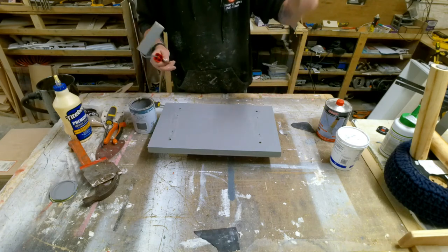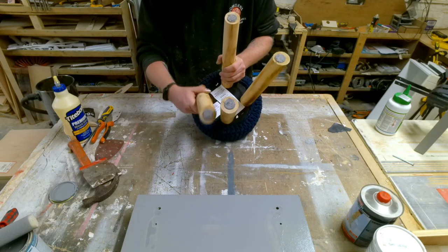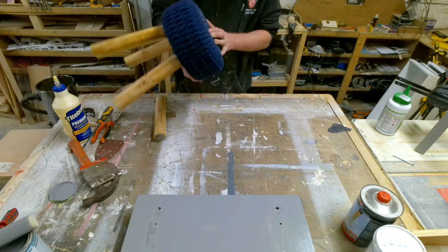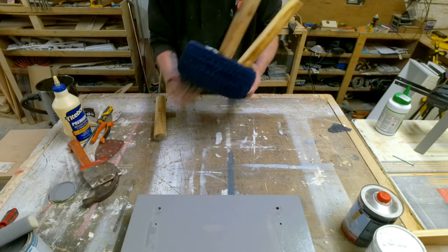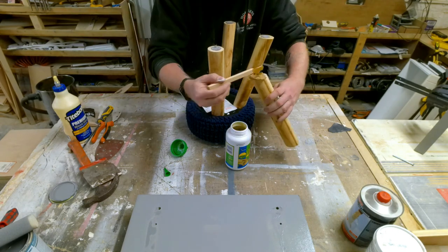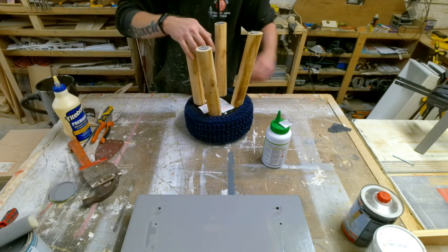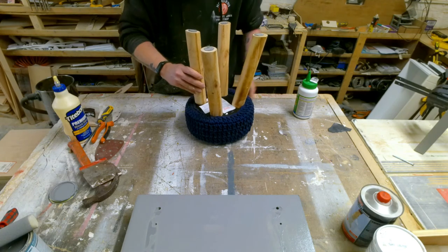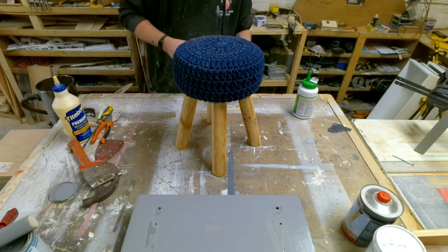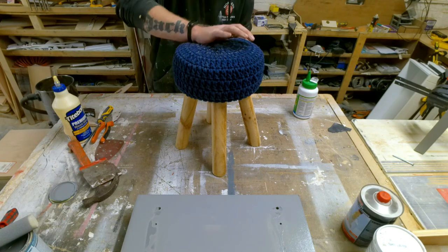While that's drying I'll set that to the side and we'll start on the round stool. This needs to sit inside here. I'm not wanting to unpin the whole thing and unwrap it to get inside. I'm going to use polyurethane glue — I've got a scrap piece of MDF. That's now sat there. I'll flip this over and put some weight on top. That glue's going to expand, get into the holes where the screws were ripped out, get into the fibres of the MDF — and that should hold it.